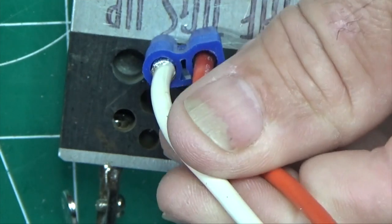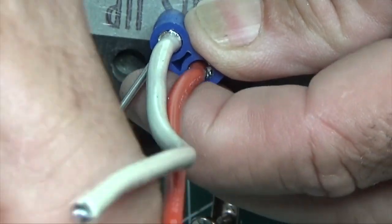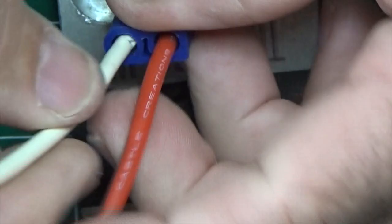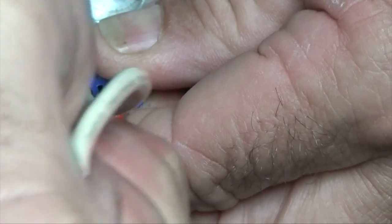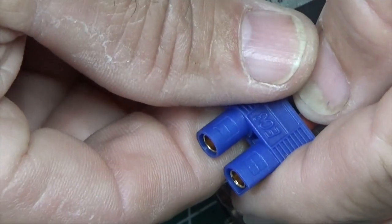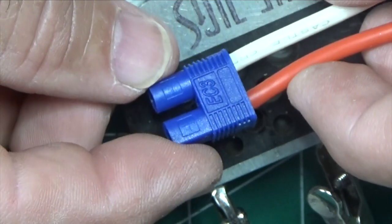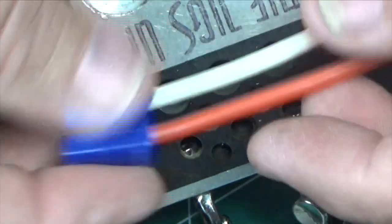Now we want to put this back in our battery connector, making sure it's cooled off so you don't burn yourself. We're going to press this in — see if it goes in without too much solder. We want to find a spot where we're not going to tear it up. It popped in — not all the way, it's got to go in farther. There we go, that one's in and ready to go. We can pull on these wires to make sure they're in there. There's our EC3 battery connector soldered and that's it for this video.